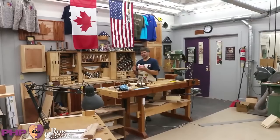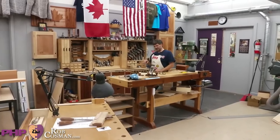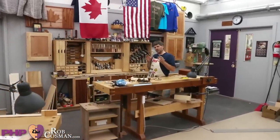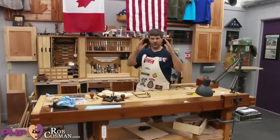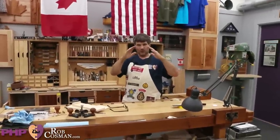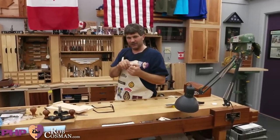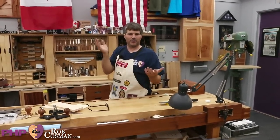I'm gonna go back and revisit that because I will tell you this, that you never want to use a sliding dovetail that doesn't have a taper. The reason is it's a very, very close fitting joint, and the go no go is extremely tight. So if you put together a sliding dovetail that actually fits properly, you've got to remember you're cutting slope against slope. You've got the sloped male portion fitting into the sloped female portion. Well, if there's any slop at all, it's loose. It wiggles, right? So it needs to be snug. The problem is you try to glue that together, but by the time you're halfway through, the glue has swelled the wood, and you can't get that thing through without beating it to death.